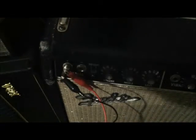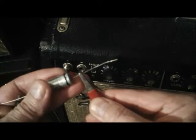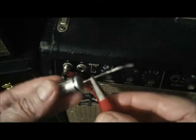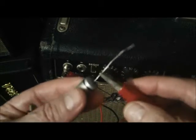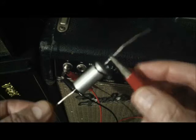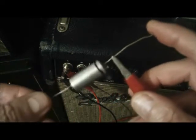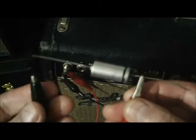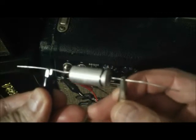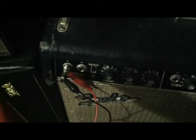On the other side of the alligator leads, we're going to take the capacitor. I'm going to take the red hot side of the amp and connect it to what I know is the lead connected to the case — because I can see it right here. I put that black line in there because I can see this lead is the same as the case of the capacitor. That's not always the case, and even sometimes when there's already a line on the cap, you want to double-check it.